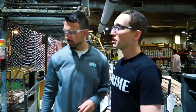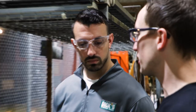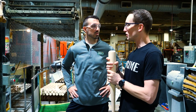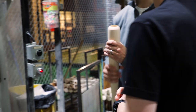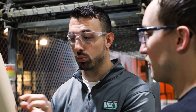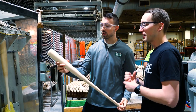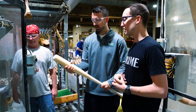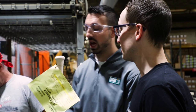The next part of the process is the bone rub machine. The big thing about this machine is we want to close in those grains. Everyone always asks what you can really do to make a wood bat better — part of it is making it super hard. Bone rubbing the bats closes in those grains, really gets them tightened up. If you really close in those grain structures and compress the wood, you make it really hard and tight. Big leaguers really love a stiff, hard bat right now — they want that super hard bat so they can trust it's going to perform at a high level. Confidence is half the battle when you're at the plate, and if they can rely on their Slugger bat, they're good to go.